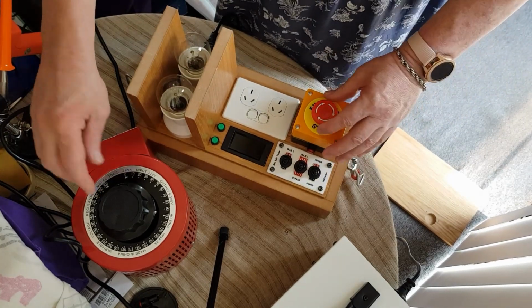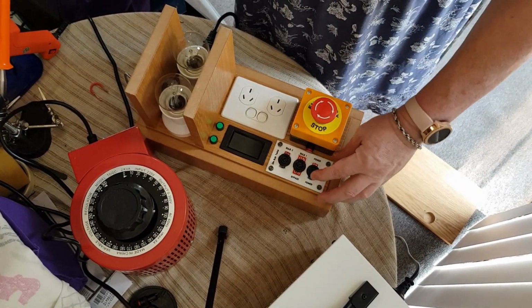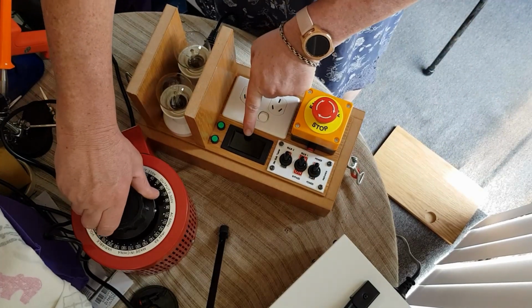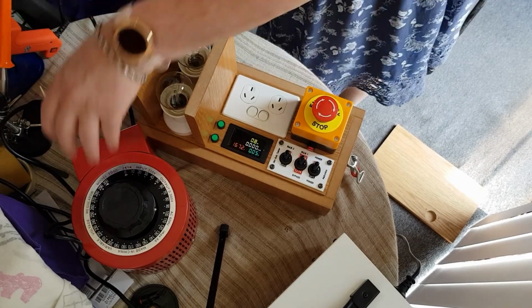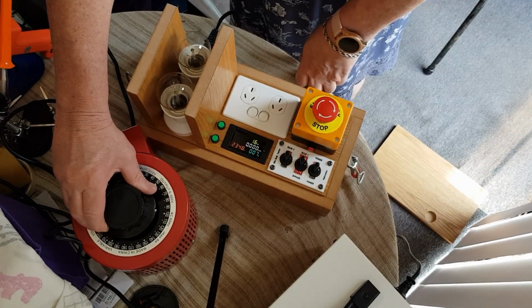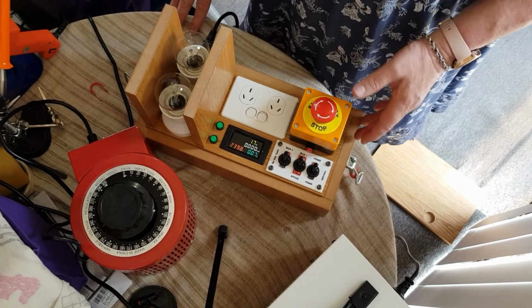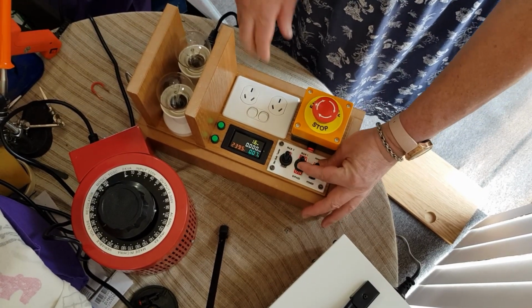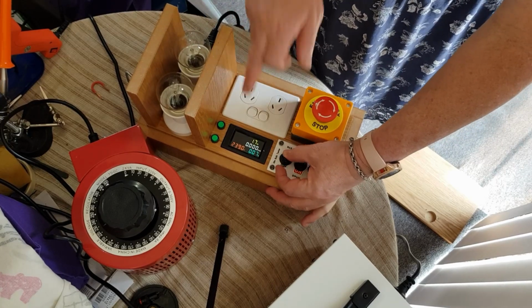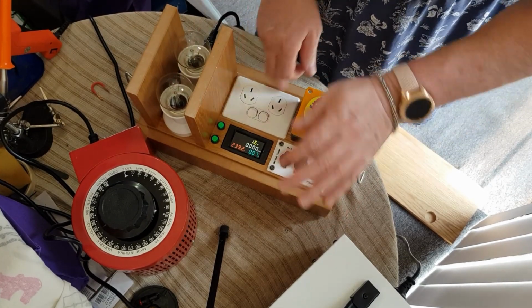So here, I will turn it on. We've got it on the variac here, so turn it on. That's up. Power on, and we'll put it on the dim bulbs first, and we'll see this here. This will start to light up soon. So 120, 200, 220, 240 here. Right, everything seems to work. The only thing is that it looks like the light bulbs here are very dim. So this is for this bulb in the circuit. And this is on the bulb here, this is on the bypass, it turns off. And of course the emergency stop, it just stops it.